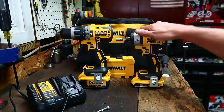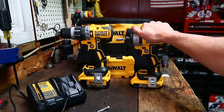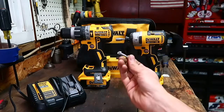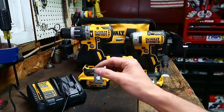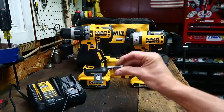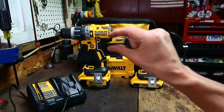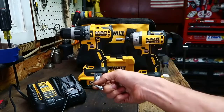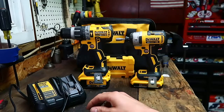It's been about three weeks. My regular impact is much smaller than this, and I never wanted to get a higher voltage impact because they were all too powerful. I saw a lot of guys make a lot of mistakes because they only had one speed. You're using one of these self-tappers for steel — these 5/16ths — and what would happen is you're drilling at some crazy RPM, then it catches threads, bottoms out, and snaps the head off before you even know what happened. Now you can't put a fastener in that exact spot because the screw is stuck in there. You could get it out, but most of the time you just try to cover it up — it's just not good.